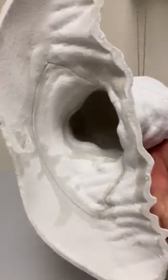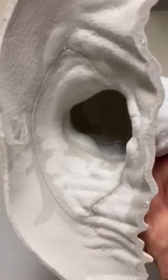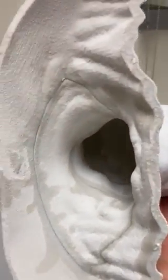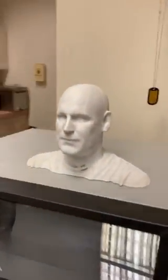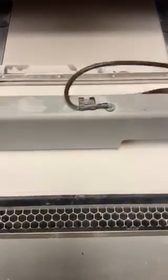What we did is we actually hollowed him — or shelled him — in MeshMixer. That's another tool you can use to save immensely on cost, because the loose powder will essentially just drop out and you're not having to spend that exorbitant amount of money on material, and yet it's still being supported. You'll notice also there is the part line right there, so we printed this in actually three parts — there's the third one back in there — and when all was said and done, there's that final print.